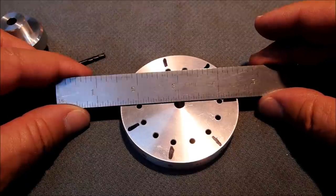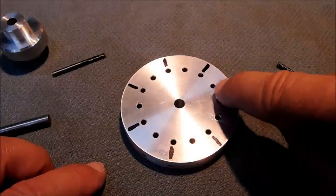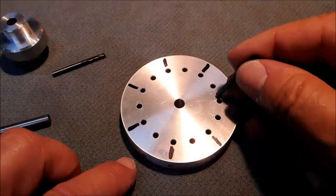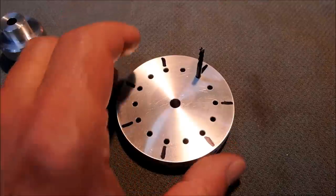There you go, 2 inch centers. Quarter inch in the center, 30 thou on either side of the projected 1 inch. Regardless of how bad your pattern is, within reason, that slot is going to do just fine. Let's move over to the mill, get this done, drill the hub.